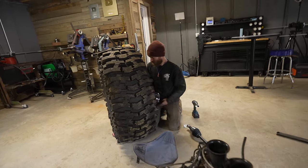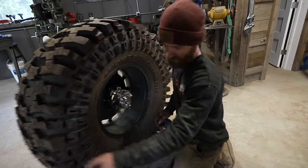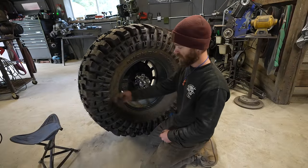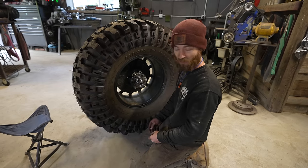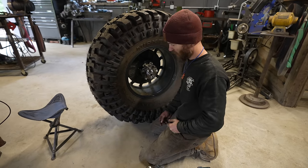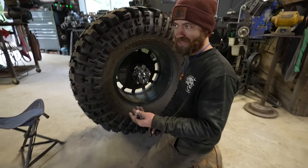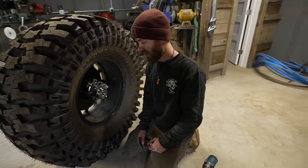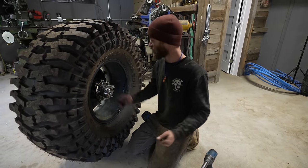Now the rear, the drive back here is gonna be pretty simple. Just chain drive, like a normal motorcycle, except with a jack shaft, because one, I need to get out past this tire, and it is considerably wider than the tire that was on the motorcycle, so the chain wouldn't line up. And two, I need gear reduction. So I'm gonna go for something like 25% so that we have also a top speed of 60, 70 miles an hour, which will probably be terrifying on this, but that way we have plenty of torque for the wheels and the added weight. This thing's gonna be a chungus.